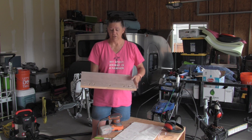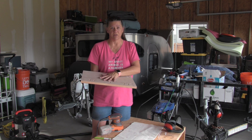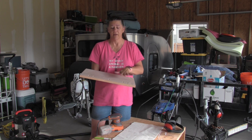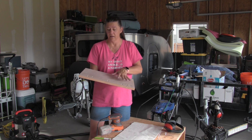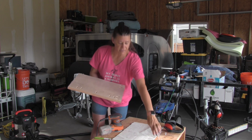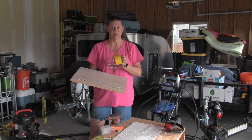Now that we've drilled all the holes, it's time for sanding. As you noticed, I had marked and labeled each piece of wood — that's okay because now we're going to sand it off. When you purchase cabinet-grade plywood it's very close to ready; you just need a little sanding. After I sand each piece I'm going to relabel it on a piece of painter's tape and put that tape back on the piece so I don't get confused and put something together wrong.